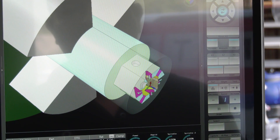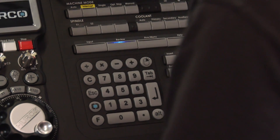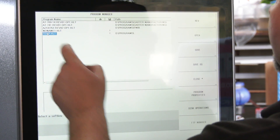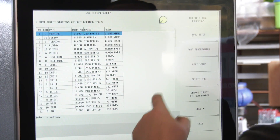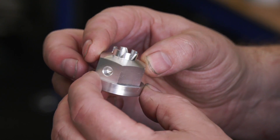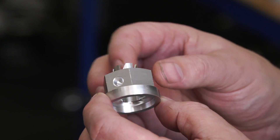What about the importing of files? Yes, you can import a DXF or bring in a 3D step file and select features — just set your datum to where you are on the machine and select features. And does the touch screen help you? Yes, the touch screen makes life so much easier. You can just create a window around things, select individual parts of the program instantly without having to jump through bits and pieces. The touch screen makes a big difference.